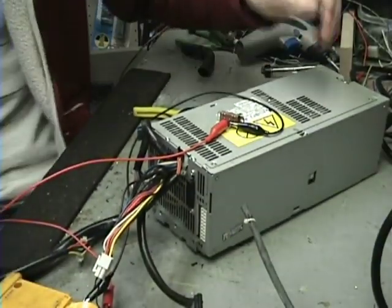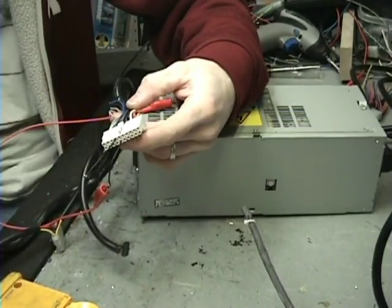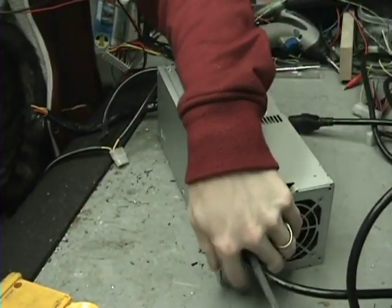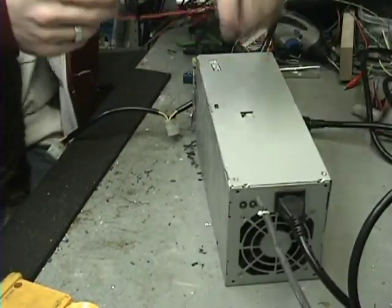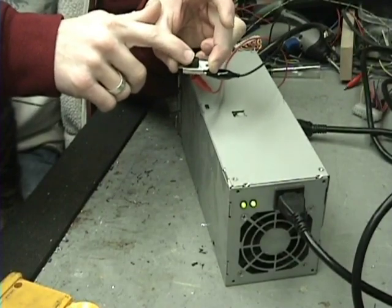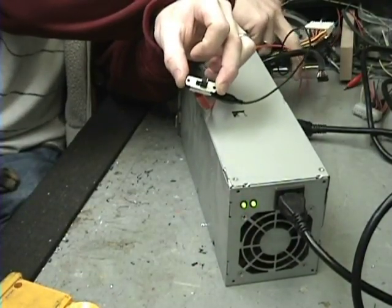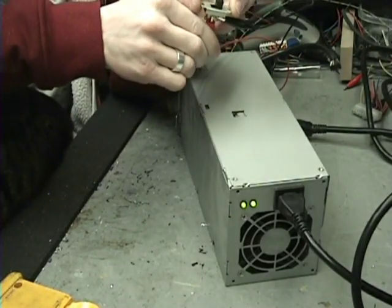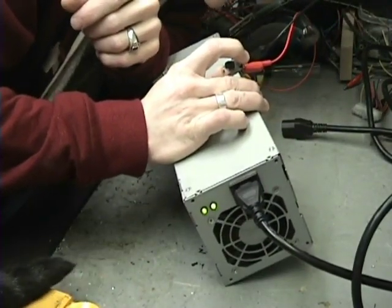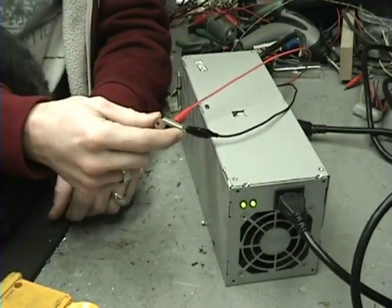I'll get you a quick look at the label after I turn it on. This one doesn't give you the color of the wire, so you'll have to check them and see what they are. On the back side there are two lights on the bottom — one is power. I'm going to flip this switch. There you go — fan turned on, power supply is on, and now you have power output on this main plug back here. Now you want to be careful and not get hurt because if you don't know what you're doing it's very likely you'll get hurt. This is lower voltages, but this thing puts out 42 amps at 5 volt — that's a lot. So be careful.